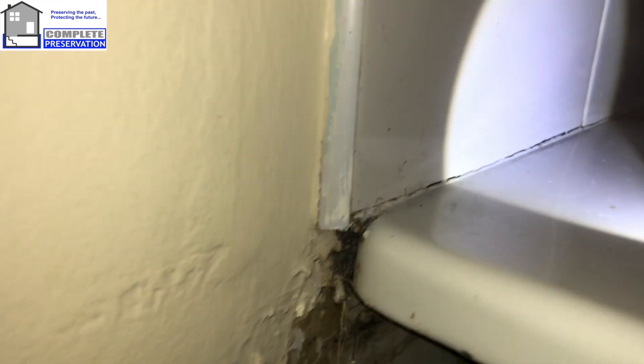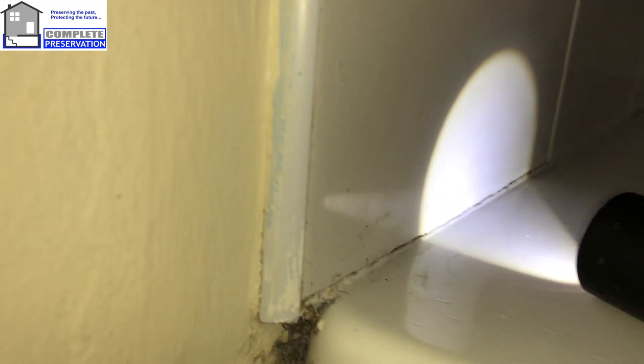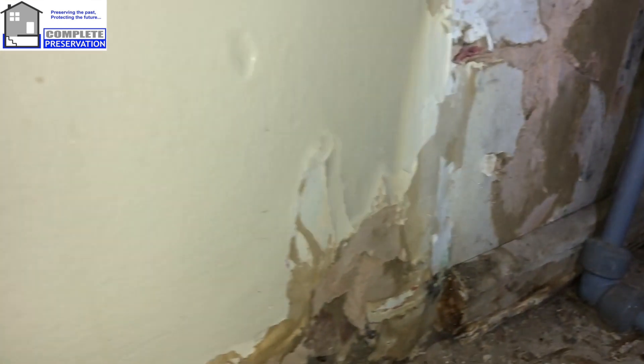I'll just change onto this one as well here. You've got a shower, and if you see here, it's got lots of cracking along now. You can just see that opening up in the cracks, and anybody having a shower - water's going to go down there. You can see the staining, you can see the water staining along the back, and down mould. These are all the sort of things we'd be looking for and testing.